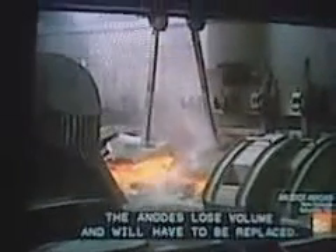That's what I kind of like — I like when they melt the stuff. It's kind of cool. It's a continuous operation. Each anode has a lifespan of about 20 days. They're alive? I didn't know that. Spent anodes are recovered from the pot with this overhead crane and carried out to be recycled. Here we see the crust formed atop the anode. When the anodes are replaced, the accumulated impurities have to be recovered from the top of the pot.